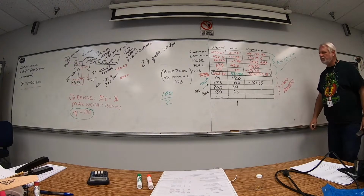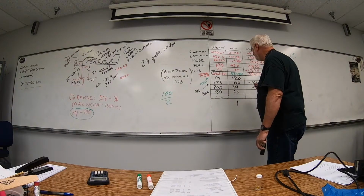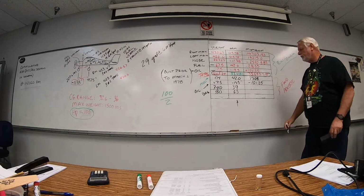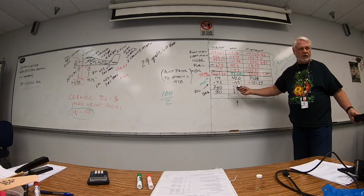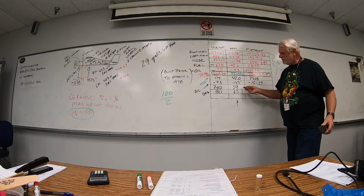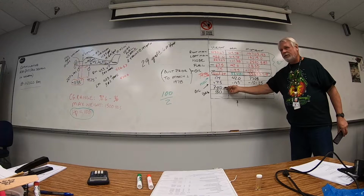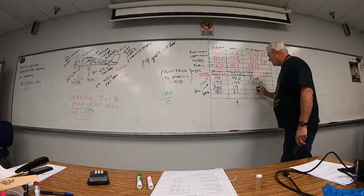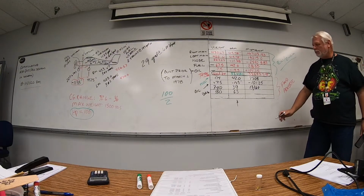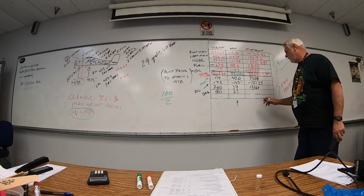So let's get some new numbers. Our fuel maxed out as per our type certificate data sheet, 174 pounds at 42 inches, is 7308. Our oil stays the same. Have to fly the aircraft with oil. And now, because of the location of our front seats, or only seats in this case, at 39 inches, it's well behind our range of 36, so we have to max that out. 170 times 2 gives us a total of 13260. Now our baggage, we maxed that out because it's way behind, as a matter of fact. 5200.